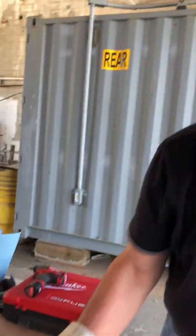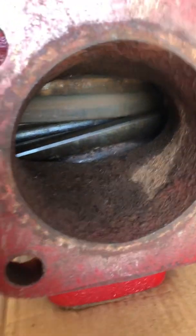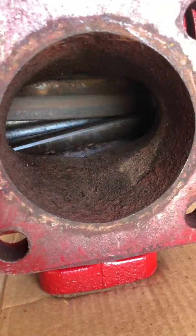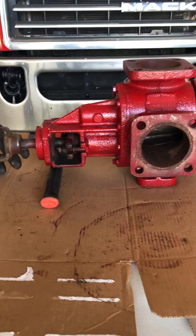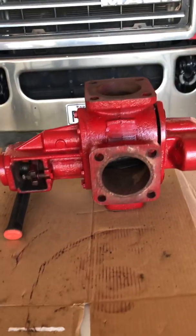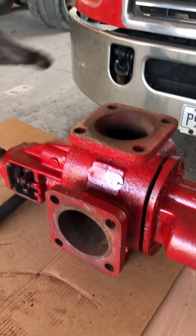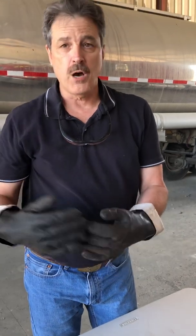The second point I want to show you is the actual gears of the pump. This is a gear driven pump — when we turn the main shaft you'll see that the gears actually rotate. This is the exit and this is the inlet. When you're hitching up to a pump for the first time, it is very important that you check the rotation of the pump. You do this by putting a piece of paper over the inlet side or on the pressure side. The suction side is always hitched to your trailer; the pressure side is always hitched to the customer.